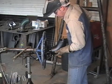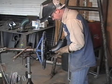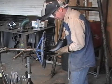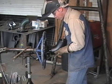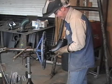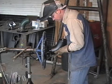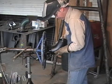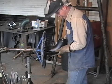Looks like I've got a little high-low. I need to adjust that. High-low is when the surface inside the pipe is not smooth and on the same plane or level — when you have a mismatch on the interior surface of the pipe. It throws your weld off, so you want to try and get that as close as you can. There are gauges and tools for that, but it'd be hard to gauge on myself anyway.